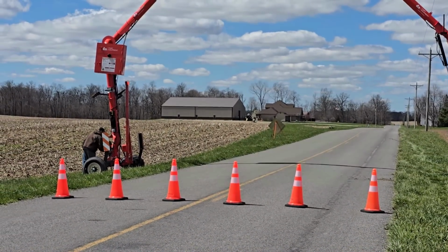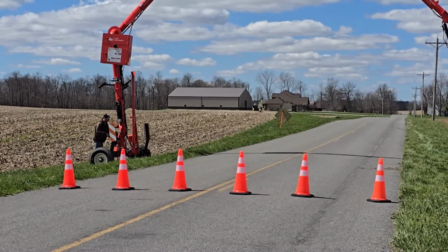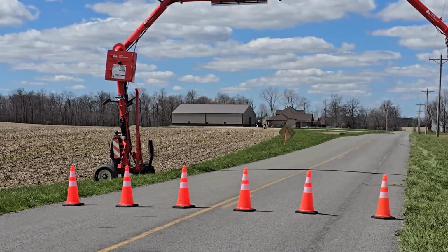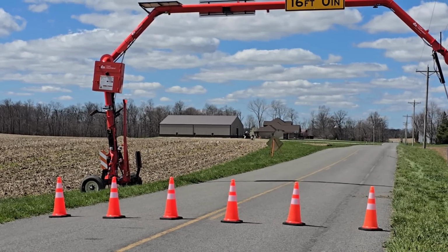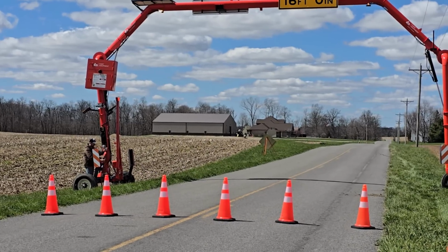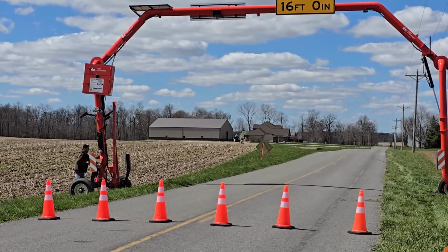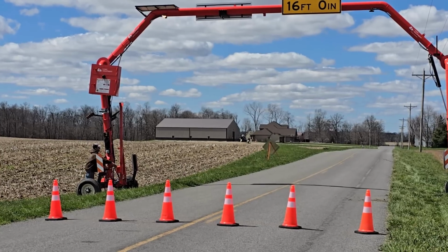And go around back and level the unit up. So I had just a little bit of a tilt here, so undo the ratchet jack lock. I'm loosening the lever up there a little bit so I can get the lock pin out. Put the lock pin in the storage hole. And now I can turn the ratchet jack to get it leveled up, exactly centered.